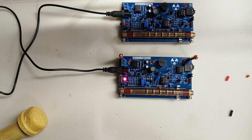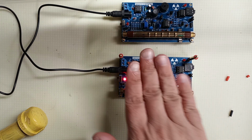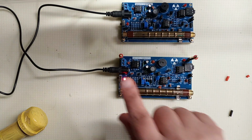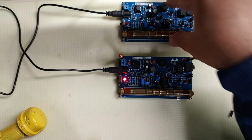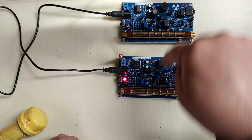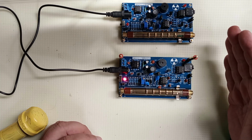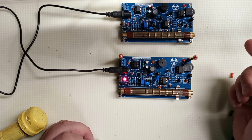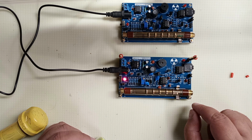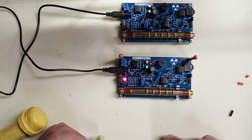So when you stack them together, you can stack a piece of thin lead plate, 1.2 millimeters, 2 millimeters thin lead plate there. Put that one on top and then another lead plate. What does that give you? It gives you the tubes lined up vertically, 90 degrees towards the surface of the earth. Anything coming straight down that can punch through both those lead plates pretty much has to be a cosmic ray derived muon.